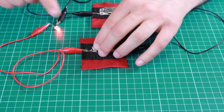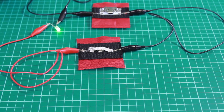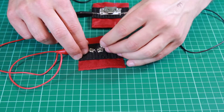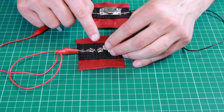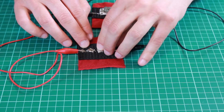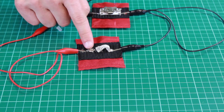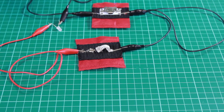So if we connect to that, we can see we've completed the circuit and the LED is on. When we remove that, the LED is off, and then we have a second popper position. The reason we have that is so that when we clip onto this, it stays in position and can't accidentally touch this popper, causing the LED to come on when we don't want it to be on.